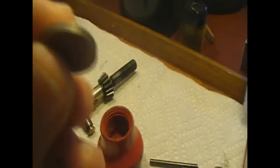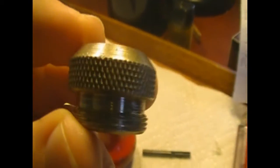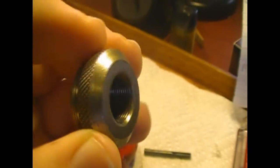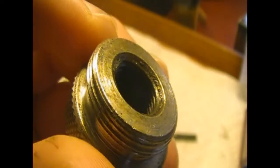The compression plate is blanked off of a sheet of low carbon steel. The top of the bit holder is made from low carbon steel bar stock. The bar is cut to size, drilled with a half-inch hole and tapped all the way through, faced on the top and right under the edge, externally threaded, and then knurled on the outside.